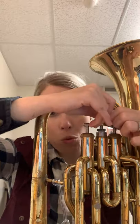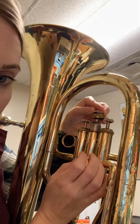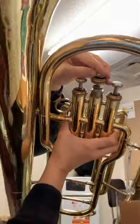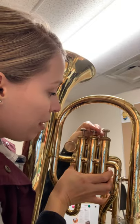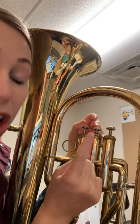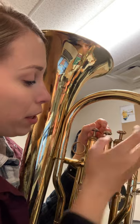After you do your spins, you want to line up your valve. I'm going to get you really close so you can see what I'm looking at. If you look right here, I'm going to lift this part and turn it until I see that notch right there. I'm going to line up that notch with the notch that I can see right there in the valve casing. It should slip right in — and it did. Then what I do is hold the valve slightly down, keeping my finger there so I can feel if this valve moves at all. Because if it moves out of the notch, your valve's not going to work — it's got to line up to work correctly. So you want to make sure it stays in the notch, and that's why I keep my finger there.